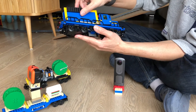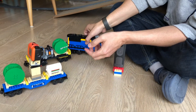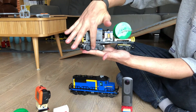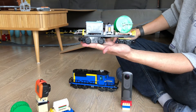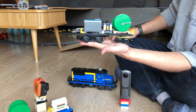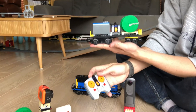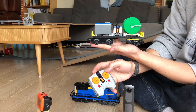That's the main engine that pulls the train. I then added another engine where you just have the battery pack on top, which creates a lot of friction needed to get up the track. I put this as the last trolley on the train so it pushes from the back. They're both on the same receiver channel, meaning with just one wheel both engines will react and go in the same direction.